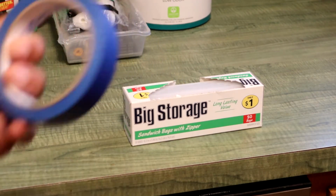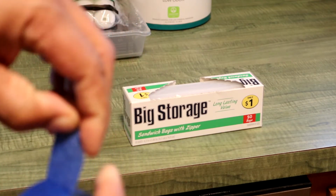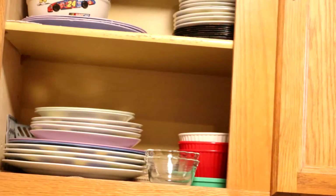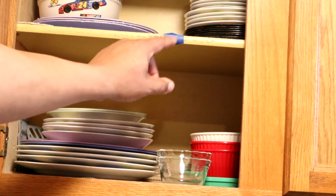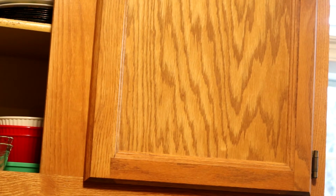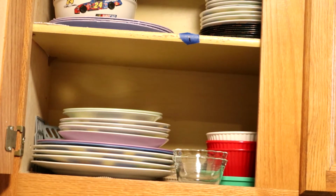What I'll be doing is tearing a piece off on each door and labeling each door, putting the piece right here and marking it. So if I was doing it, this would be 1, and this one here would be 2. And just label them all. Then I'll label the bag 1, just like this, and I'll put 1 up here, so that when I take the hardware off, I know what door it belongs to.